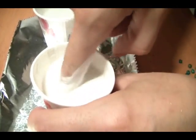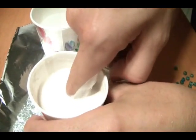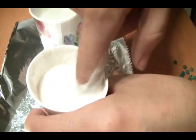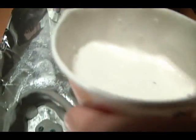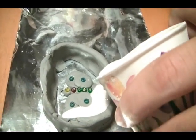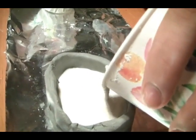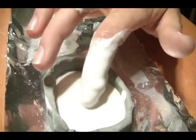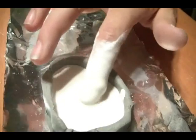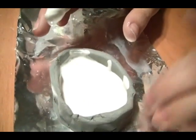I've got a nice thick plaster — it's pourable but very thick, almost like go-gurt. I'm now going to pour that. Because it's hot water, the chemical reaction will occur quickly, but I'm pouring slowly, letting the plaster fill all the little cracks and bubbles, and I'm not making it really thick — I'm choosing not to go to the top. I want to easily be able to crack this plaster off my final mold with a hammer or even my bare hands. Now I'm just tapping to bring the air bubbles from the surface of my piece to the surface of the plaster.